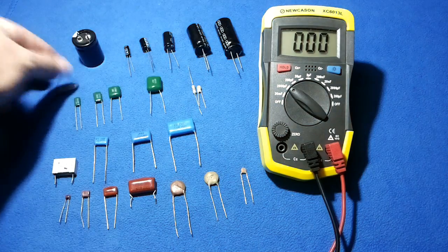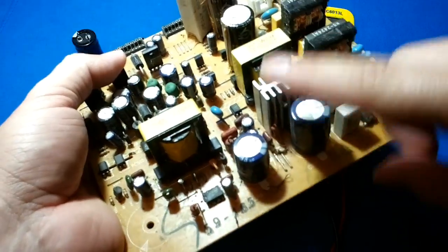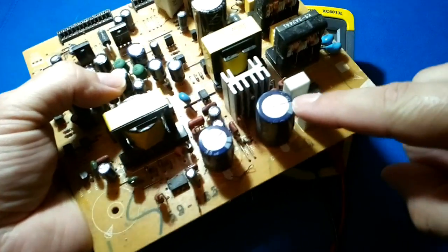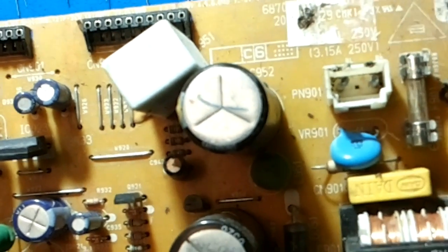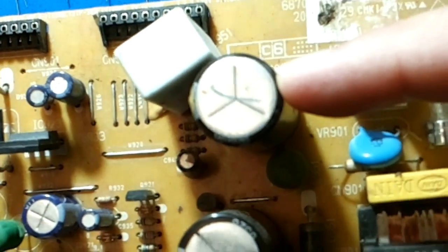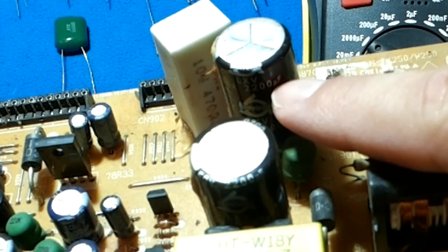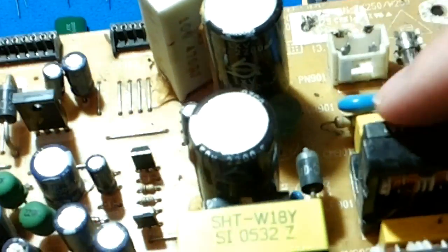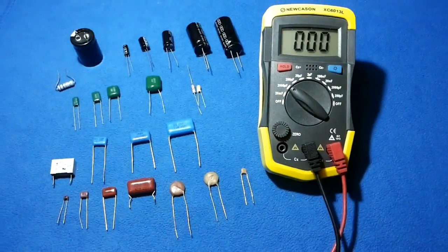Another aspect to pay attention to: when capacitors are on a printed circuit board in a switching power supply, some may look fine on the surface. But if you see the cover skin splitting or moving away, that means the capacitor was overheating and the plastic has started to deform. If the top of the capacitor is bulging, ready to pop or explode, or the skin has moved away — just by that visual inspection alone, you know you have a bad capacitor without needing to measure it.